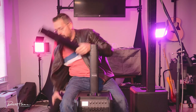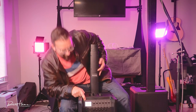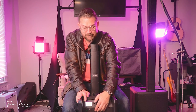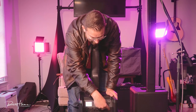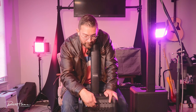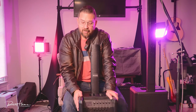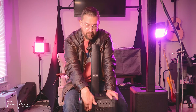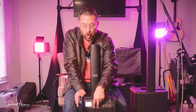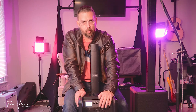On the input side, keeping the battery in, we're turning on and we've got all our inputs — three XLR combo jacks and then two smaller ones. One is quarter inch and then the other is eighth inch or Bluetooth. You can also power this by mains power — tap and hold and it'll come on. These first two inputs are phantom powered and you have all of the digital effects: reverb, Lexicon, and ducking applied to all of them. This next input does not have phantom power but has all the reverb, chorus, and delay. The high-Z input, which is input number four, is great for things like your guitar and takes up to two mega-ohm impedance. And then finally the auxiliary input, where you don't have any of the additional features. Your most powerful inputs as far as most functions start with one through five in that order.